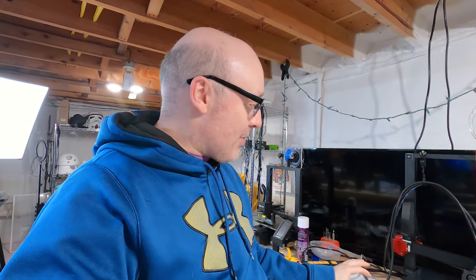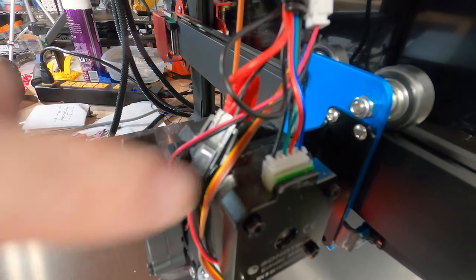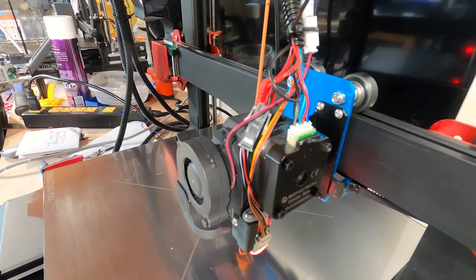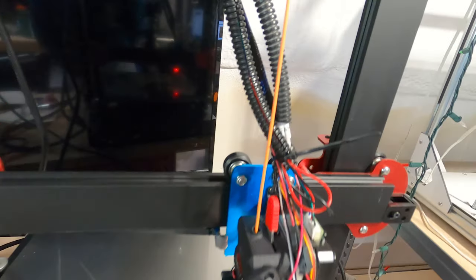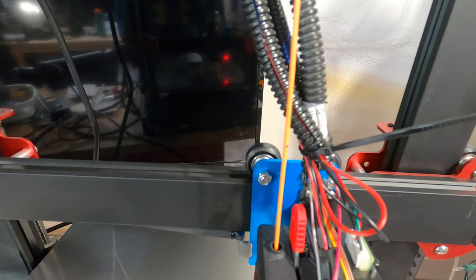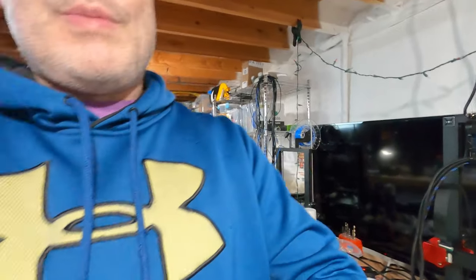A lot of challenges. And one of them was the extruder was grinding. Now, right now I have it doing the E-step, so it's slowly melting some plastic through here. Problem was the wiring. Had to do a little research and find out which wires went where, and finally got it right. And so now it's no longer grinding and jumping around, it's moving that plastic through. And you can see the little mark I have here in black. It's hard to see, I think, but that is slowly moving through, and that will tell me what my E-step should be. So progress continues.